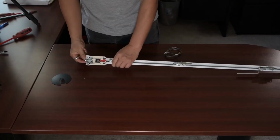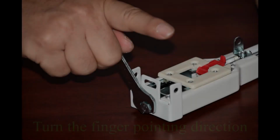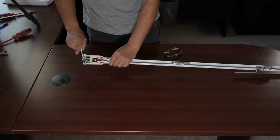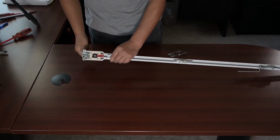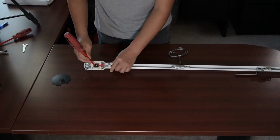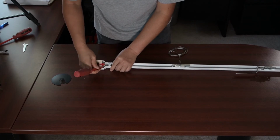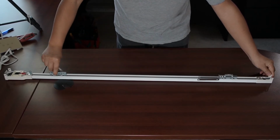Take a wrench and turn the screw on the end clockwise 5 times. To test the tension of the drive string, take an item and pluck the wire. The wire should vibrate a little. Use your hand to move the carriers to test if the movement is smooth.